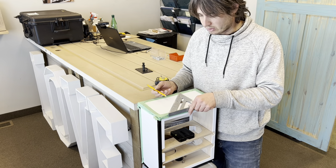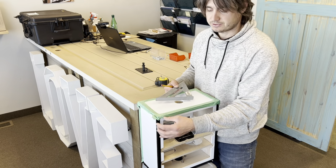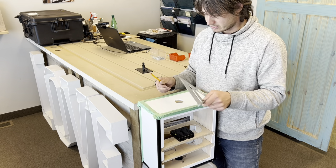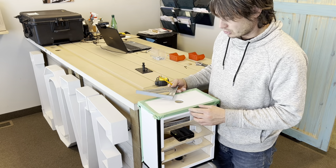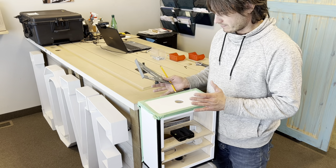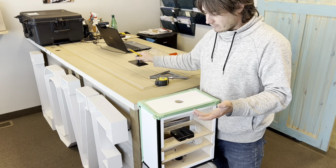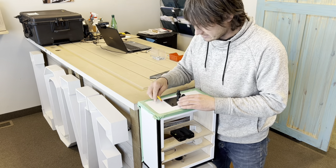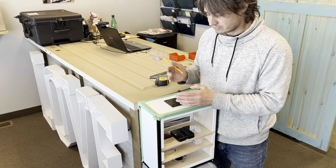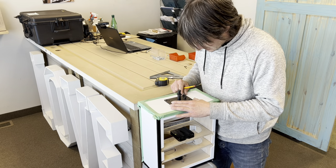I'm squaring this. Note I'm not on the corner — because if I'm on the corner that corner kind of pops out. Remember we put that corner piece on, so you definitely want to square it from just the edge there. It doesn't have to be absolutely perfect beyond comprehension, and this should suffice because if this is straight, that will also be straight, and we know exactly where we want it based on the lines we drew.